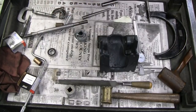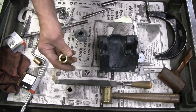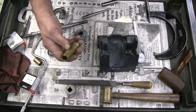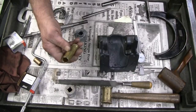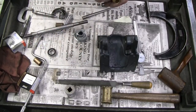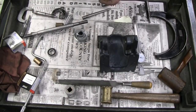I have a couple of pieces of 5/8 ID, 7/8 OD brass tube. I'm going to turn down one end to about an inch and an eighth, turn that down to three-quarter or less, and then part it off to approximately two and one-eighth inches. Let me go do that and then we'll come back and see how things are stacking up.